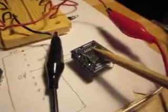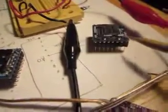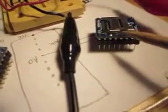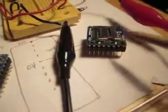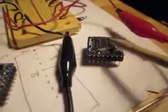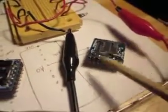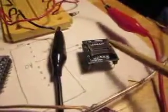In fact, this is not even centered correctly on the board. It's actually more to the left, which makes it even closer to the solder connections here, and again it shorts out. These are the speaker connectors, and it shorts against the metal here. We got short here to the tray, so even shorting here to the other side. So it's basically a major issue with these, I guess inexpensive ones, is you have to make sure that everything is clean, nothing's shorting out.